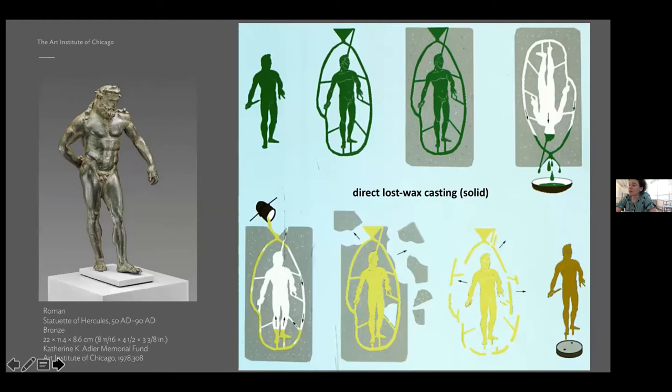The process of casting is pretty much unchanged and is done by what is called the lost wax casting method. Reduced to the most basic possible terms: you make a model of something in wax, then you replace this with liquid metal. You model up your wax and attach to the outside a whole network of what we call runners, sprues, or gates — to allow all the gas and metal to flow freely around the casting space. You then embed all of this in a refractory — a material impervious to heat, usually ceramic.